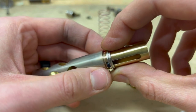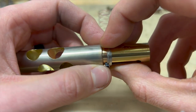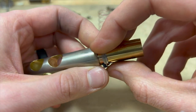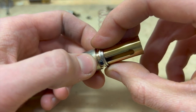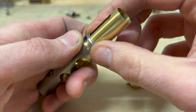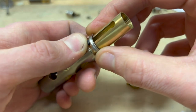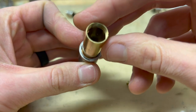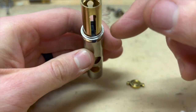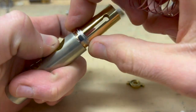It's well suited and fit and built onto the dog bone. I'm not fearful it's going to break off; if I made it taller there could be stress and it would snap off. That little tiny ledge keeps the ring from budging forward. You can see the dog bone is moving with this ring, and that dog bone is going to be slotted into the valve casing while that ring won't move. There's very slight tolerance but we don't want anything binding up. Making sure you're following this instructional video correctly: all of the laser engraving on this ring should be facing upwards when you're putting it all together.